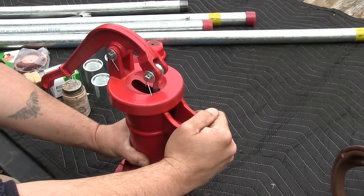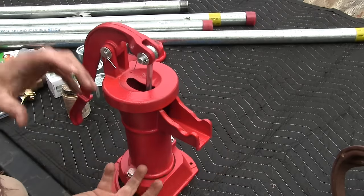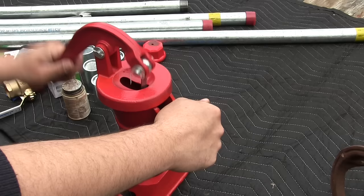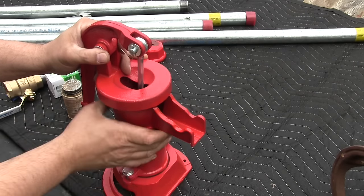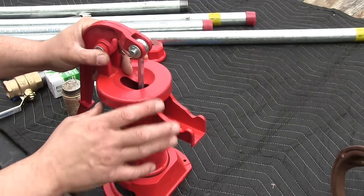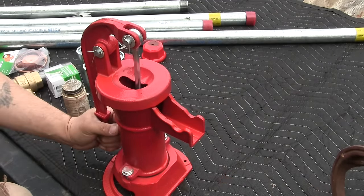Make sure your well is topped off, put your hand in front of the pump so the water doesn't spill out, and just start pumping. That will start bringing water up the column little by little. After about 30 seconds, once your water column is full, it'll just start running out the top — and at that point your pump is primed. The pitcher itself is full of water and the water column all the way down to the drive point is full. The plunger goes down, pulls the whole water column up just a little bit, and water spills out the chute.